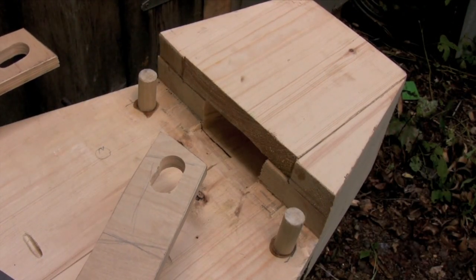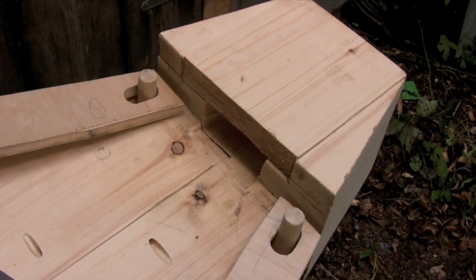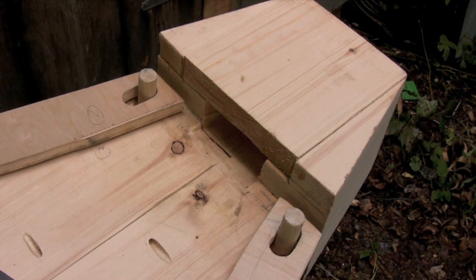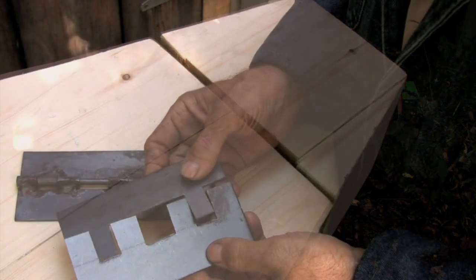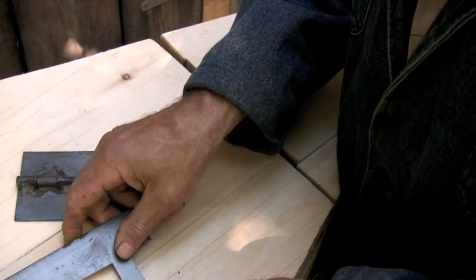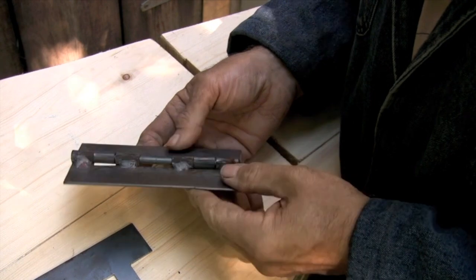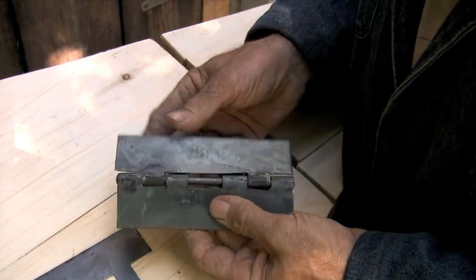The upper and lower chamber has a floating rib that is used to control the leather on the bellows and keep it from billowing out too much. This rib just needs to be loosely fitted over pins. You don't want to be installing hardware that could cause problems later on. The hinges are made from 14 gauge sheet metal. They're just a basic rolled hinge but I've welded everything together to make sure that there's no way that they're ever coming apart.